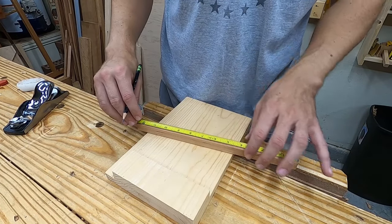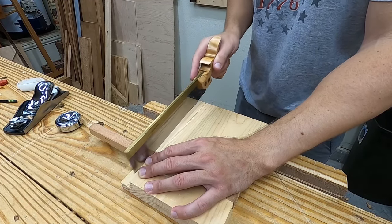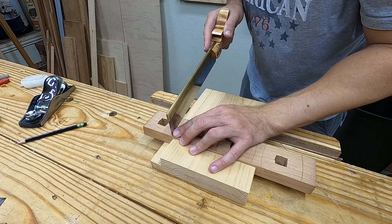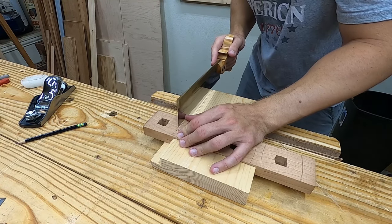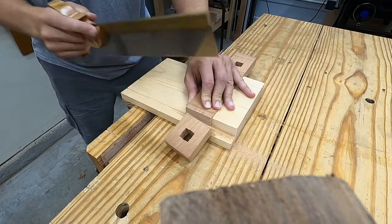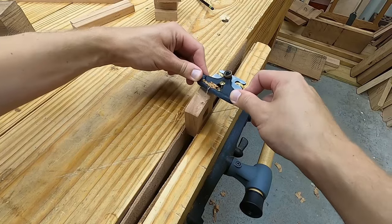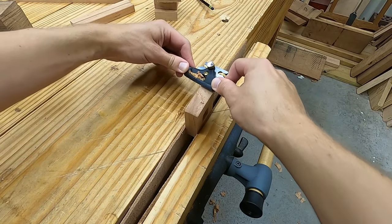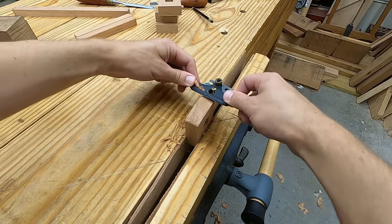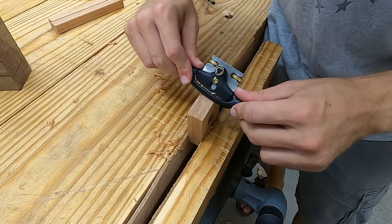Now I'm going to cut this in half to make the beam. Each beam is going to be 6 and 1/4 inches long. With my bench hook out, I square some lines and cut off the stocks. As with when I cut tenon shoulder lines, cutting a notch at the front and the back and then connecting those two notches helps keep this square. Now, to shape the stock, I'm going to use a spokeshave. First, I'll knock off the corners and then round it off side to side and also slightly from front to back. I do the same for the top and bottom of each stock.